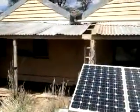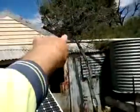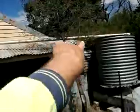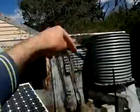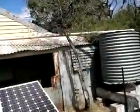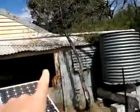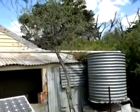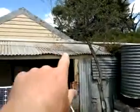How I worked it out was that bit of ridge capping that was missing from that beam, just running down the side of the corner of the veranda, the one I had to put that bit of sheet metal on and rivet on there. The original sheet there had a mark from where the ridge capping was, and that actually trimmed one side off a little bit. I only realised that after I put the wrong sheet up. But anyway, it didn't matter, and a lot of them pretty much lined up anyway.